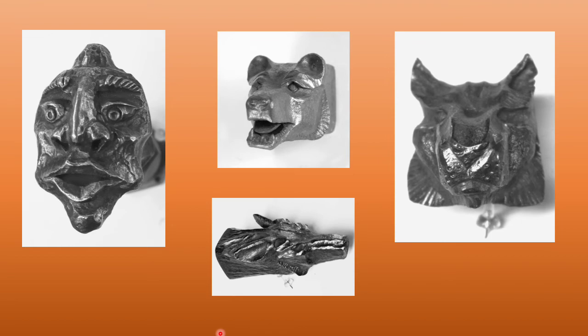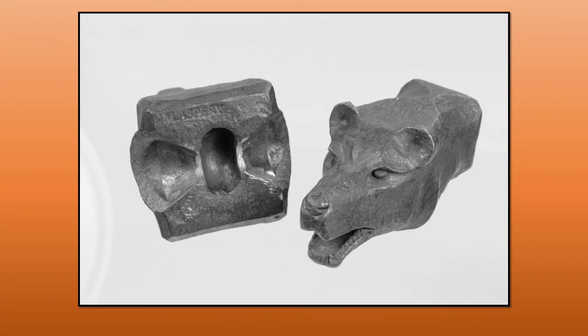Now that you've got your bear's head, you can use the same tooling to create many different styles of heads. With the wolf at the bottom, I didn't use the curved chisel to cut for the jaw but I did use that same chisel to cut for the ears, once I'd shaped the ears with the fuller. As a side note, if you're involved with the CBA blacksmithing curriculum: if you can make the bear's head then you can make the swages for the welded collars of the level 3 grill, and vice versa. This concludes the first of the three sessions of the bear's head. Look for Victoria and John's presentation on forging the tooling, and the last session will be an interview with Darrell Nelson who pioneered this style of forging. I look forward to seeing you at a future CBA event — take care, bye.